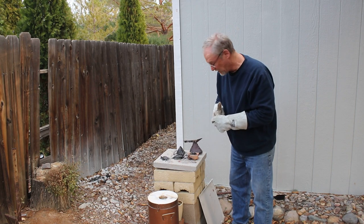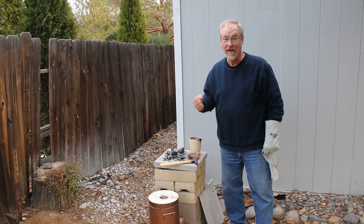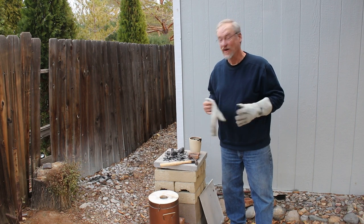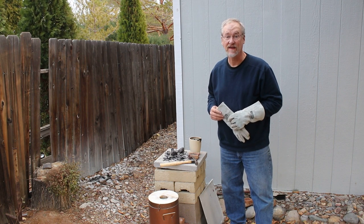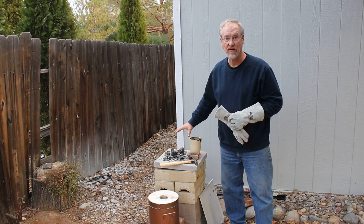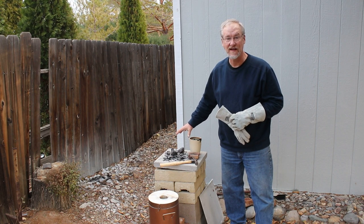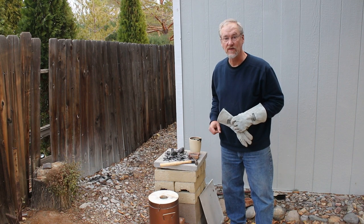Doesn't look like we have any real obvious metal. Let's see if there's some on the inside of the slag. Well, I don't know what to say. I've gone through all the slag material and there was not a button of copper. There's a whole lot of matte material here, the molten sulfides that melted. We got them melted, but the iron just didn't react.